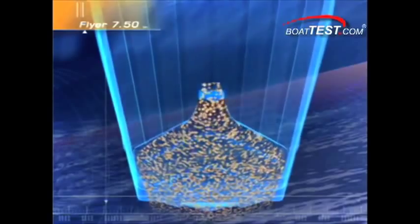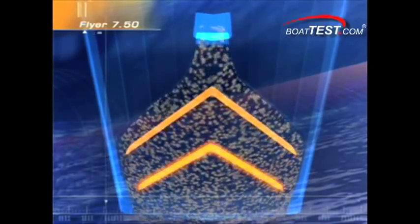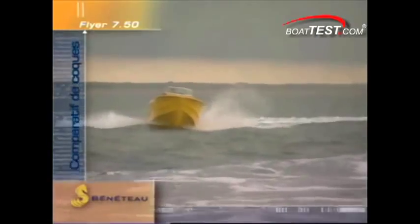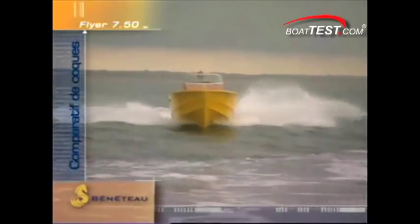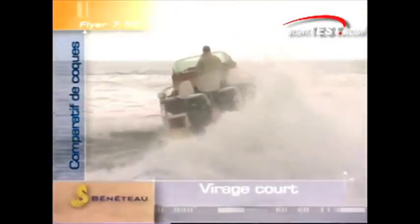So how do they create a large contact surface area while preventing air from running off the sides? They duct the air through the hull of the boat and then vent it through the keel to a specially designed section of the hull — their AirStep. The AirStep system takes air from two locations on either side through the freeboard about midship, and that air is drawn under the running surface as soon as the boat starts moving forward, thanks to a low pressure created at the stern.